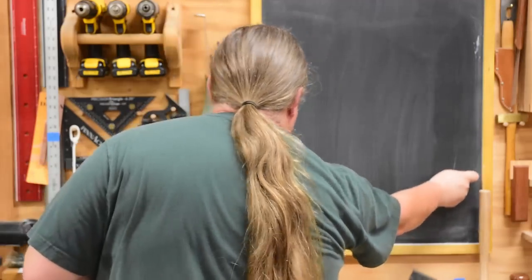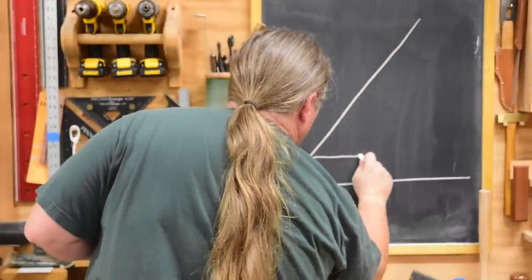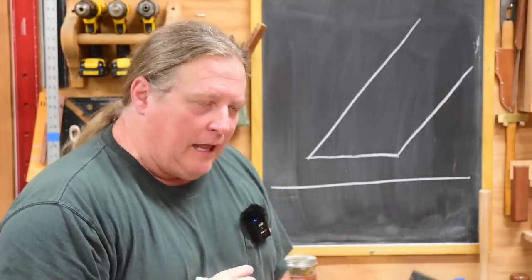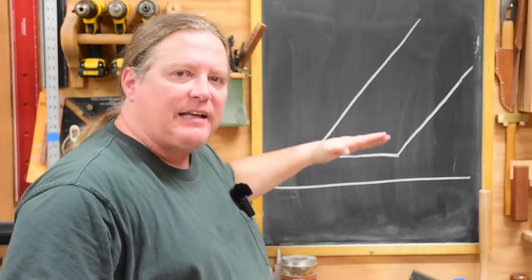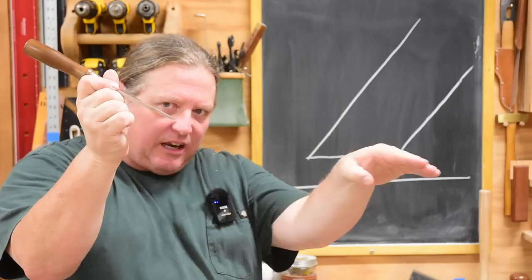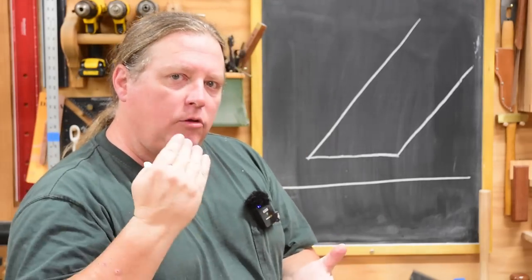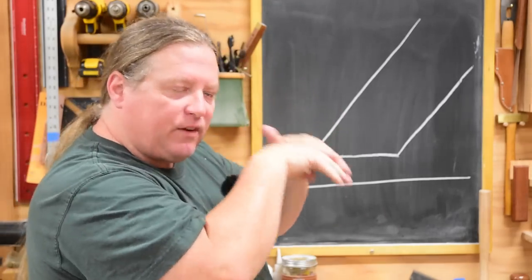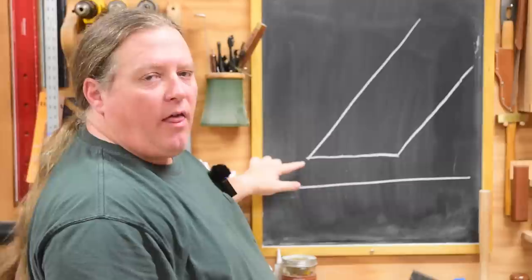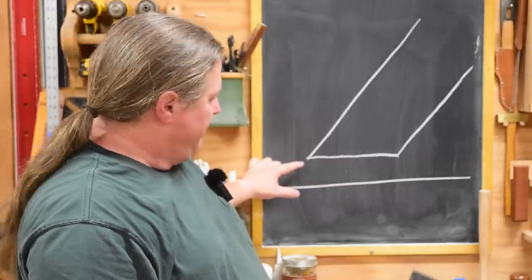You have a block of wood, okay? And then we're gonna have a chisel right here. Now, majority of people, when they are thinking about chisel sharpening, kind of the holy grail is to have a perfectly flat edge. We're talking, this is the bevel side, you put it down here, and this is the cutting angle right there, okay? The way you get that is every time you sharpen, you have the edge set at a perfect angle, and you remove all of this material just to get that to two angles that go on for infinity, two vectors that go on for infinity, okay?